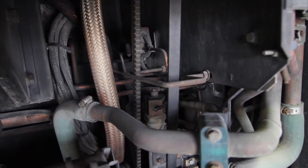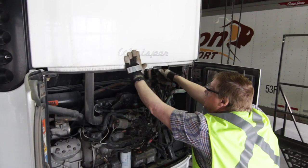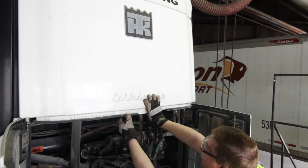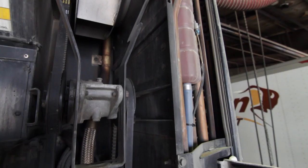You're also going to want to check the coolant level. This might be a little bit tricky for people who have a shorter stature, but your best approach is to hold on to the top cover while you flip this lever right here. You're going to want to continue holding onto it because you don't want to let go — it may flip completely open and then you won't be able to get it down again. Just continue holding it and you'll see the coolant reservoir right there, and you can make sure that's full of coolant.